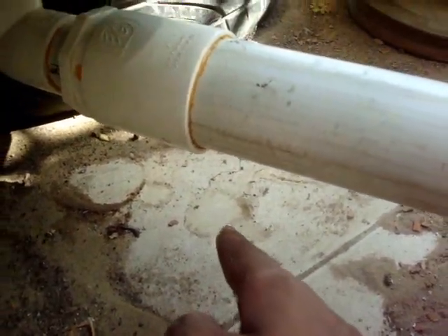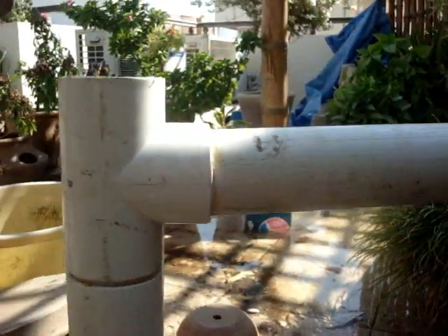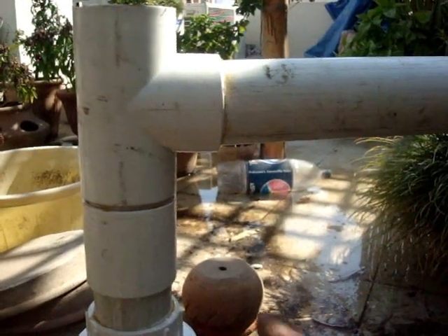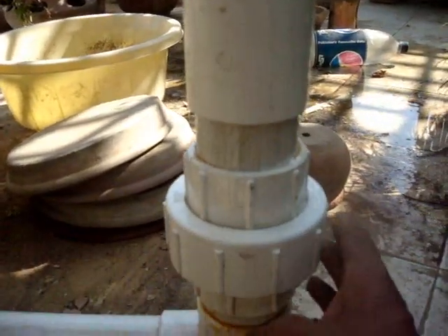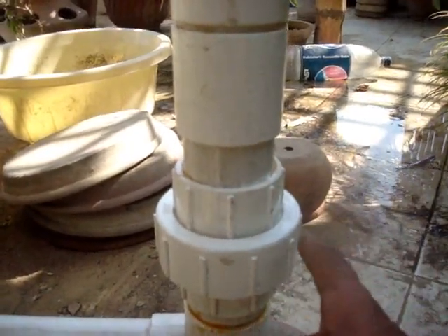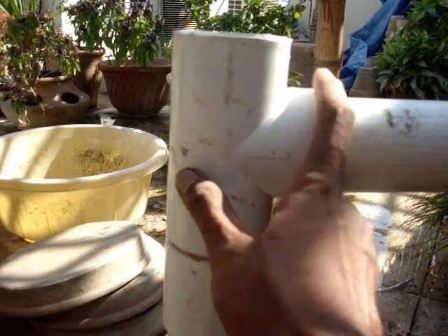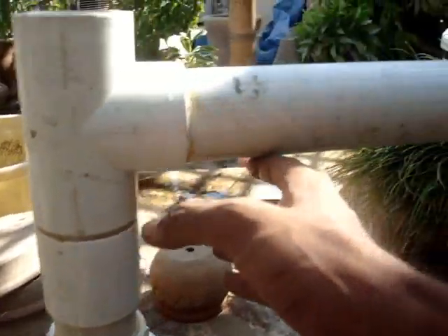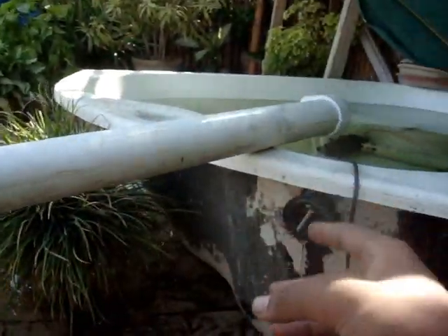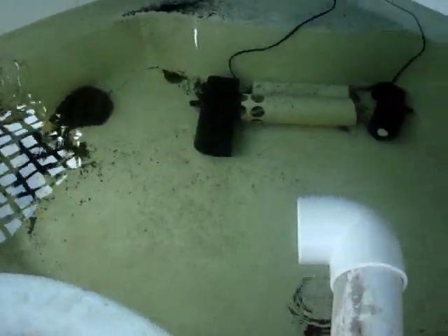You can see that little itty bitty puddle of water down there. These things probably just happened because when I put in this pipe it's just a little angled up. I forgot to put in the union again. Be sure that when you make any sort of fitting, put in the union before you glue tees or elbows onto it. I did that wrong twice, which is why I've got these leaks, and the pipe is just a little angled up — it's overflowing because I overfilled it a little bit.